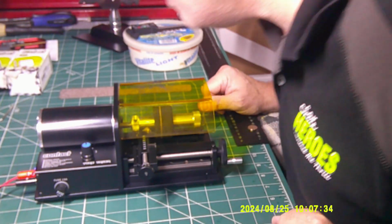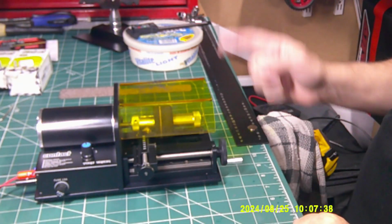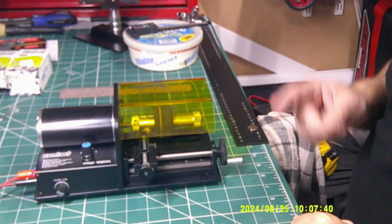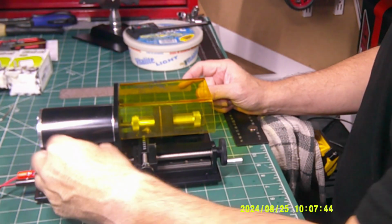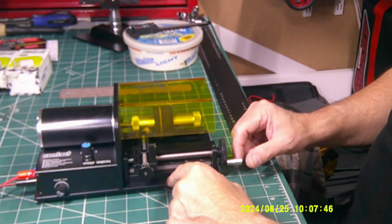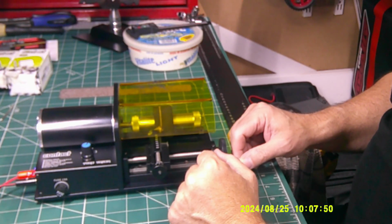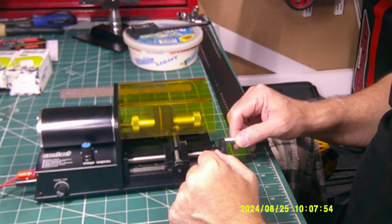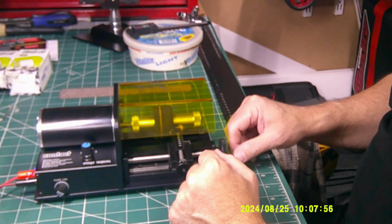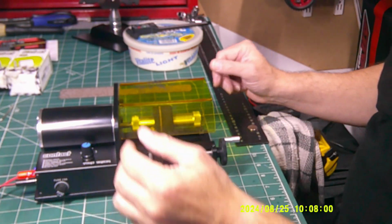I'm just checking, yeah, so it will turn from here away from the tool, so it's turning where I'm sat clockwise. So then if I just skim, it's very light, so you can tell that it's not actually taking anything off, so we know we've got it set right.